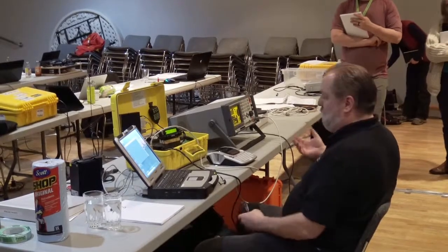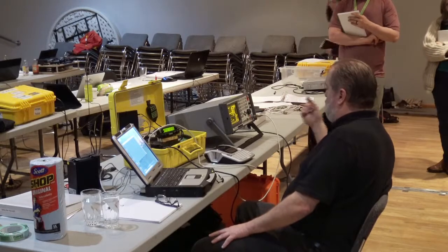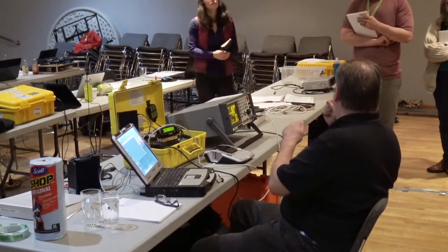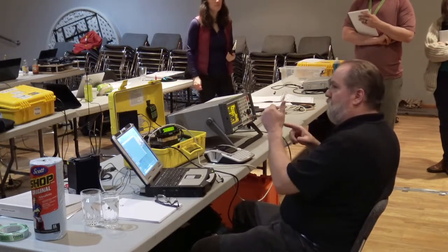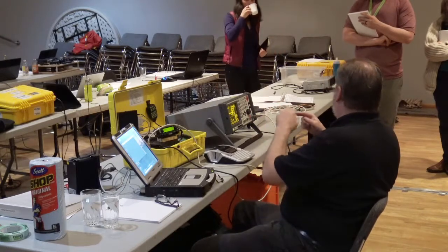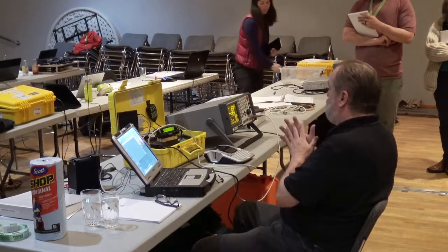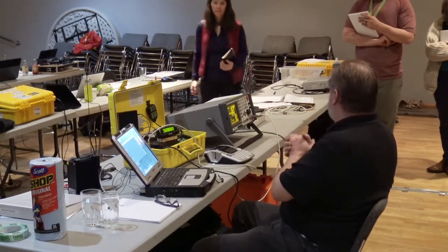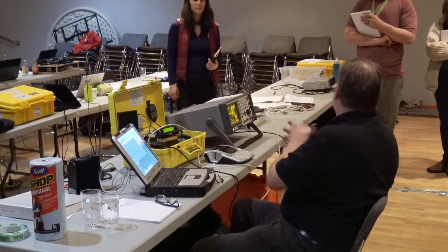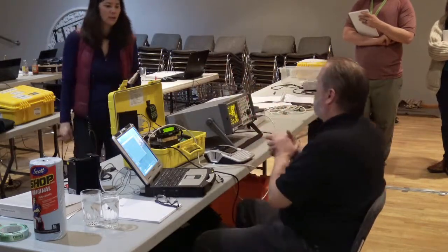The things that I see are when people have the power on and go to plug the DC cable into it, and they don't have the Kantronics one, the nose of the connector is exposed plus, and then when they go to put it in, it hits ground, and then it burns a trace inside the TNC. I've seen that twice. I've had to repair two of them. Other than that, I've only seen one other, and it was one of mine. It all of a sudden just stopped working. I haven't even had a chance to fix it, because I have a few others.